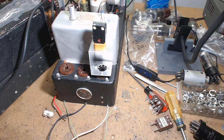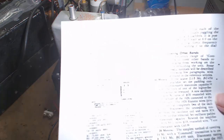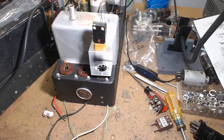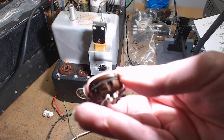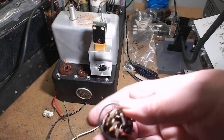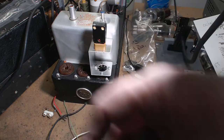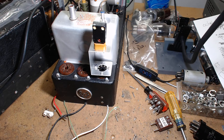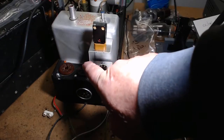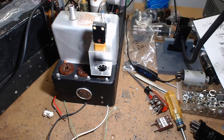I have almost every part in the world here, but somehow I get a project that even predates my stuff, like those special sockets. I've never seen them until I saw a command radio. So these things were popular probably 1920s to 1935, octal, and they fit in one big hole. And like I said, there's a ring you work on the bottom, and to get it back apart, you work the ring back. It's a ring similar to the one to hold your car keys, similar but not exact. I think I covered everything. The next video will be the tube mounted in here and it working, showing on the scope. I think that's it. All right, that's it.